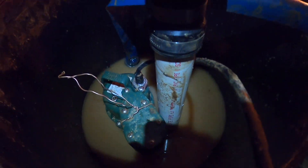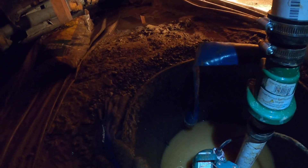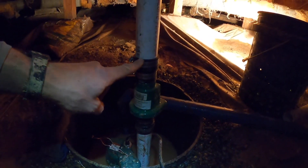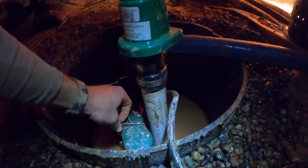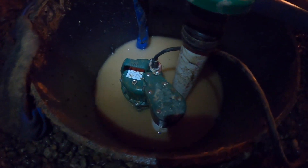There it is — the sump pump. This is just the temporary hose I'm leaving in there; it's full of water. Then there's the riser and check valve to ensure flow in the right direction, with clamps on. The water is now going out front. I'm going to take this wire off before we plug it in and give the PVC cement a chance to set.